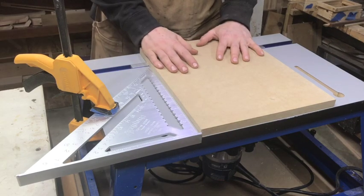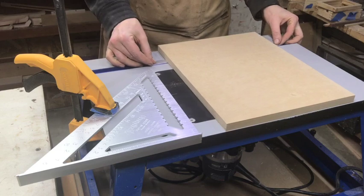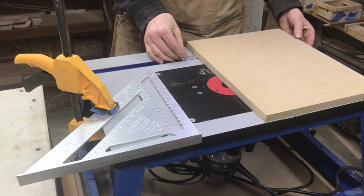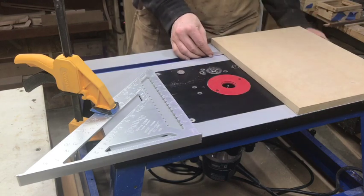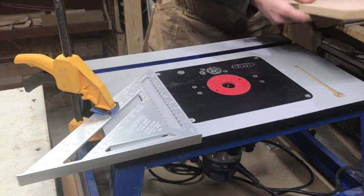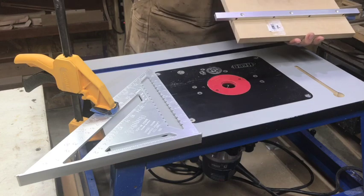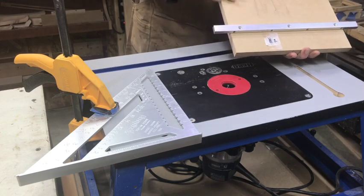Now that we've held this down for about 30 seconds, we're going to slide it out. Slide it by just pulling the miter bar. Don't pull on this. You don't want to knock it off at all. If you've got dimes under there, they may fall out, so make sure to catch them as they go. And we're going to then lift this out of there gently. This should be, if you used a good adhesive, stuck to there. So at this point now, we're going to just do 3 pilot holes, screw that in, and then we'll go from there.